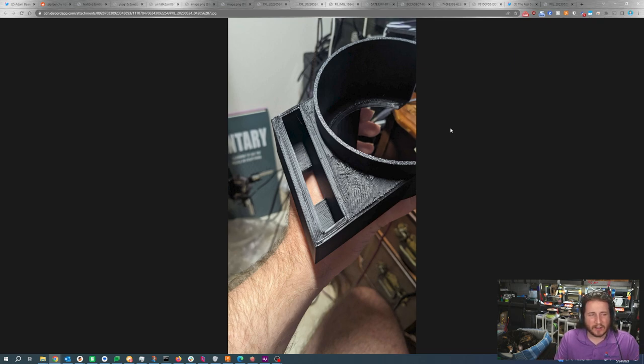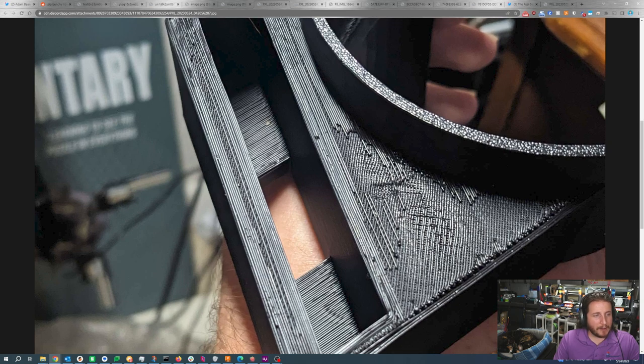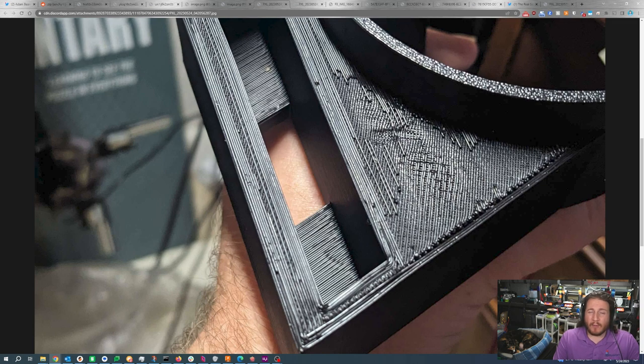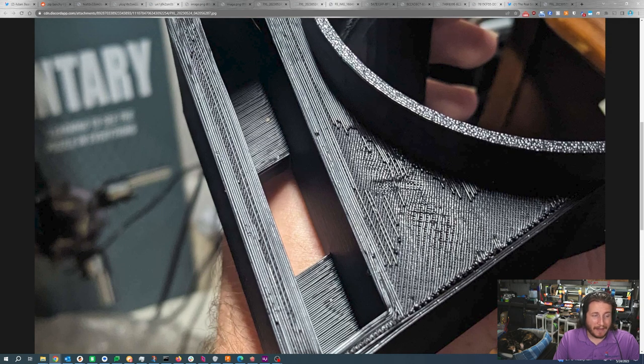Next up, a fail from our editor Andrew, who built a cup holder expansion for his car and, having not done too many things regarding support material, was wondering why the heck the bottom of his parts looked so bad. In this case, Andrew, it's because you ripped the bottom layer off. The bone stock SV06 actually looks great. What we do see are the infill lines not connecting with the perimeters all that well — in this case you would look at increasing your infill overlap percentage so that infill comes a little bit further over and hopefully connects with those perimeters. The bridge actually looks pretty darn good and probably didn't even need any support.